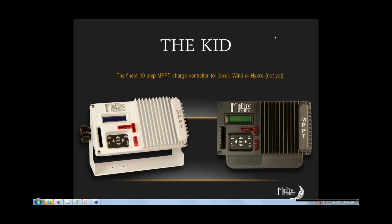Okay, so you're in a series parallel configuration then with 12-volt batteries? Yep, 4 12-volt. Okay, sounds good. What's the amp hour rating of those AGMs? 260. All right, so you've got a 520 at 24 then? Yep. Okay, 520 at 24. All right, that's good.